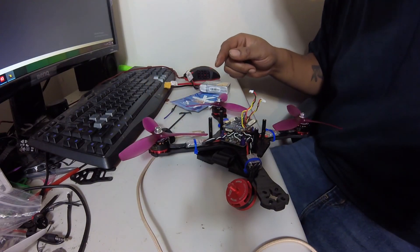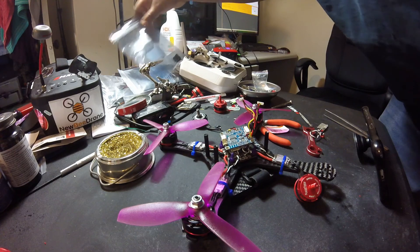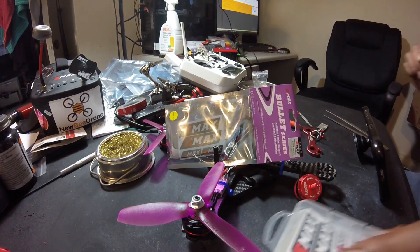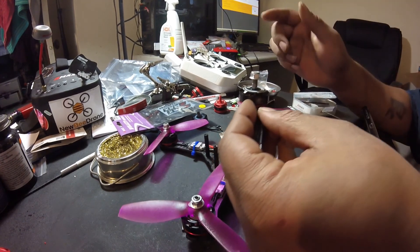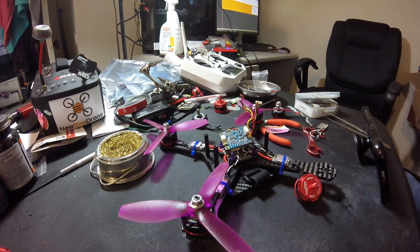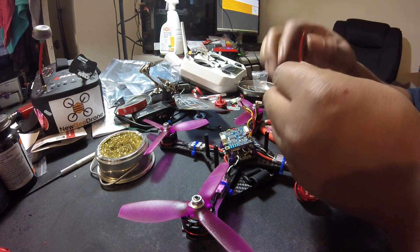Let's get back to the table and I'll show you what we're going to do. Now that you've seen that go down, what's going to happen is we're going to replace that ESC. I can't find my stuff — excuse my mess. There's the ESC. And there's the fresh motor. I'm just going to swap these out — swap off that ESC, swap off that motor. Hopefully we won't have any more issues. We've got a brand new 2205 2300 kV Red Bottom ready to go. Swap that on there, and then another Bullet 30 amp. Swap those and we should have a solid flying quad.